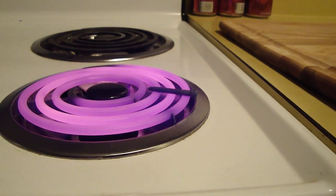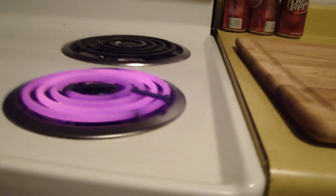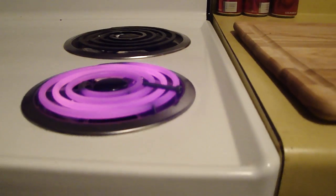Now, a lot of people don't have a tap, don't want a tap, don't want to deal with that, and that's the real way to make threads. But we can make a homemade tap very easily, or a bottoming tap, because essentially a bottoming tap doesn't have this taper on it, so you can make threads all the way into a blind hole, which a lot of paintball guns have. So if you need some extra thread because you strip something out, you can make a bottoming tap like this. And so what I've done here is, this is a 10-32, relatively long one. I like the Allen heads because that gives you something nice to turn it with. And you can't see right now, I'll show you after we are done with it, that I have essentially filed into this as primitive of a tap geometry as possible.